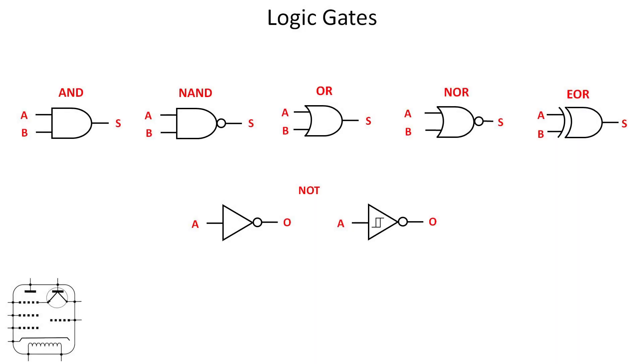Let's start by having a look at the theory of the first two gates we're going to be exploring. One of the things that's characterized our previous looks at logic gates is that they've either had two inputs or one input. I've put the two types of NOT gate there — the conventional inverter on the left and the Schmitt trigger version on the right — but essentially they do the same job. It is indeed possible to get Schmitt trigger versions of some of the two-input gates.